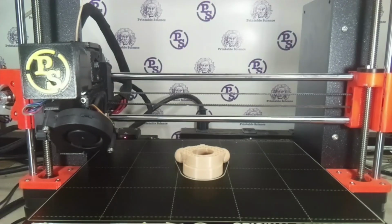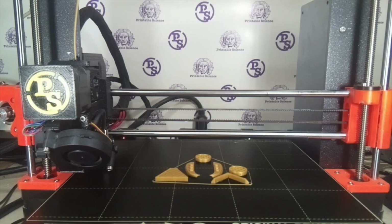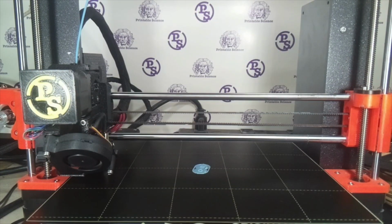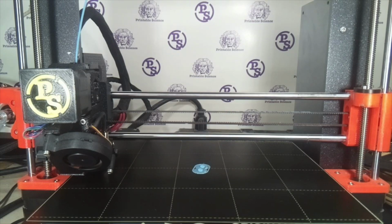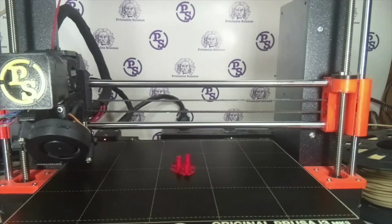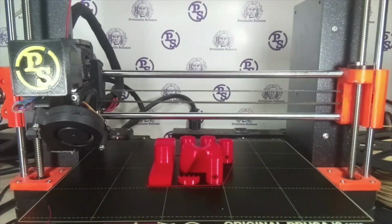All the parts were printed in PLA with a 0.4 millimeter nozzle, 2 bottom layers, 3 top layers, 2 perimeters, and a 20% infill. I used a Prusa Mark III's for this project, primarily so I could take advantage of the time-lapse features of Octolapse, which is a plugin that runs with the Octoprint management program.